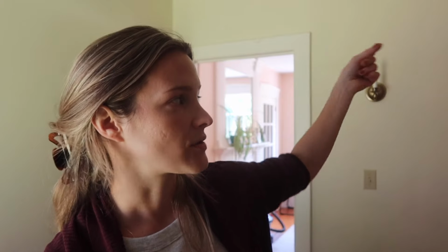There are going to be some tricky parts about that because our walls are not straight. We have pieces of face frame that will be right up against both walls, so those will need to be scribed. I had to create some filler pieces and shim a few things out, so some of the areas that are touching aren't exactly 1.5 inches, so we will need to cut some custom pieces for that. So it will be a little bit slow.